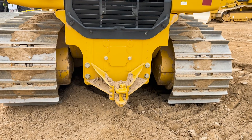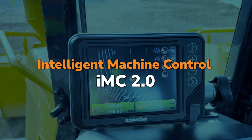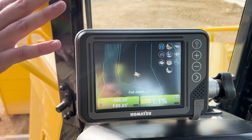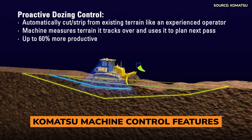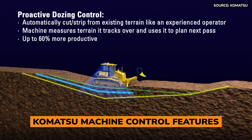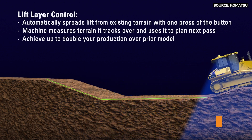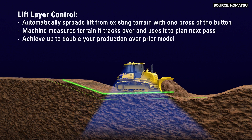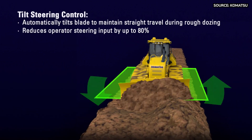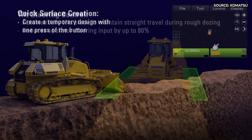Options include scarifiers off the back and winch packages — multi-use, standard from factory. Just like our excavators have LCI, when you get to our dozers you get EXI. The 'I' signifies the intelligent machine control portion of the machine, built by Komatsu engineers, so we utilize 100% of the machine. We say 'grass to grade' — we want customers to use 100% auto. The machine knows how much it's pushing, so we don't track slippage. Your biggest owning and operating cost on a dozer is your undercarriage, so longer life undercarriage is better for their bottom line.